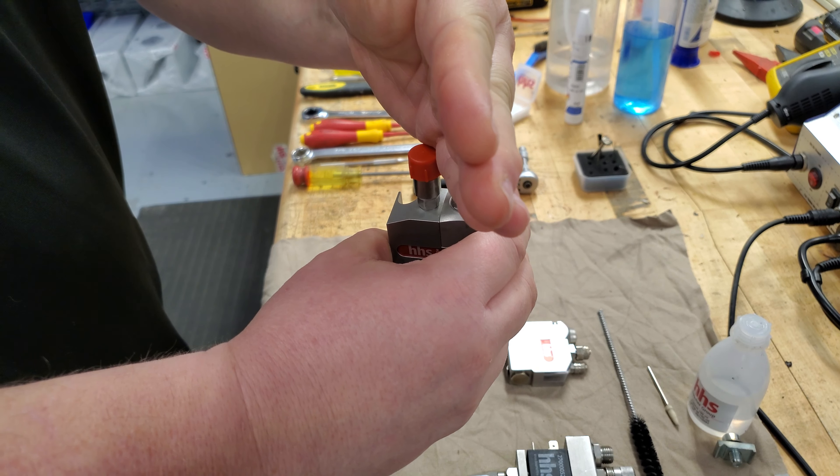This is the DLK 400 series. Again, it's going to be very similar to the first two. This one's got a ratchet style stroke, just like the PL500. So you're going to bring it all the way down clockwise. I'm going to use my flat tip screwdriver point there as my reference. I'm just going to bring it down, there's quarter turn, half turn, so I'll just put it in the middle. That's my starting point for my adjustment and fine tuning. That's basically it for setting up the heads.